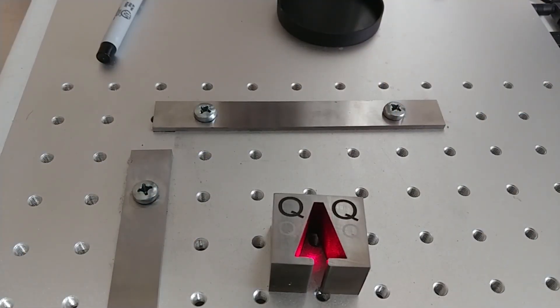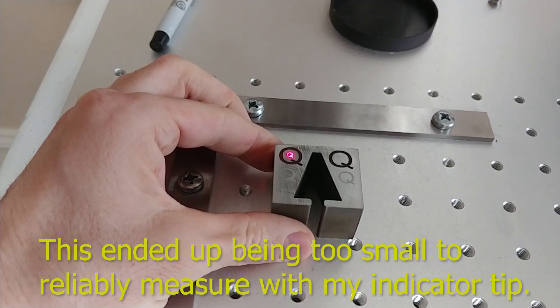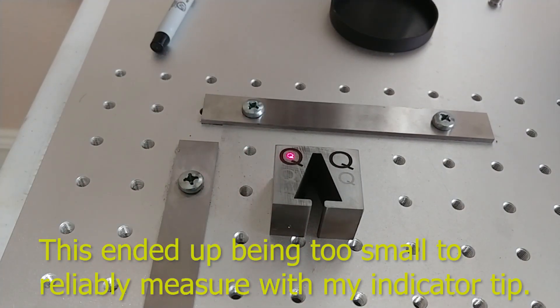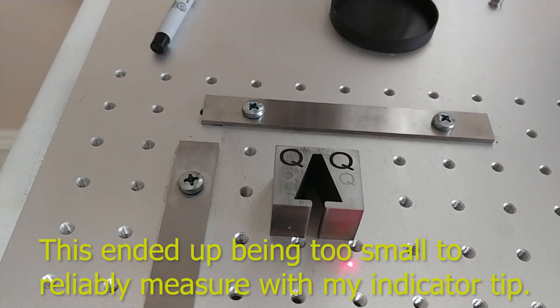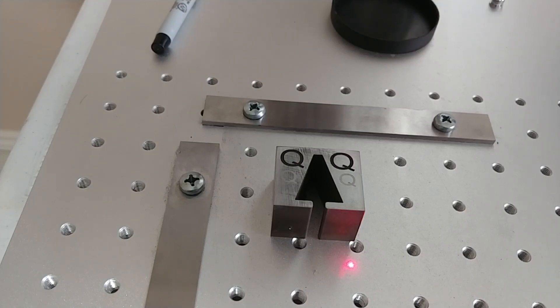Okay, let's do one more. Let's put a tiny Q inside the Q we just made and see if we can get deep. Let's also do a circle in the other Q. I'm going to slow this down to 100 millimeters per second, and it's going to be 90% power again and 20 kilohertz frequency. We'll keep the same three hatches as before.